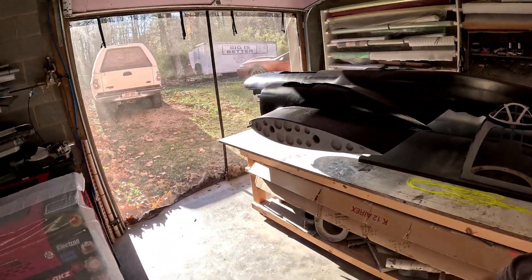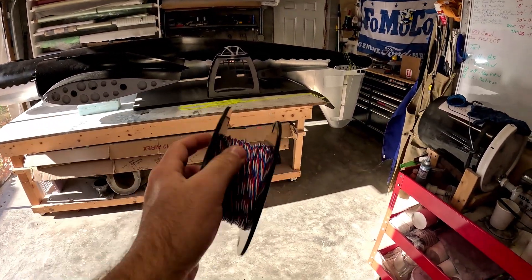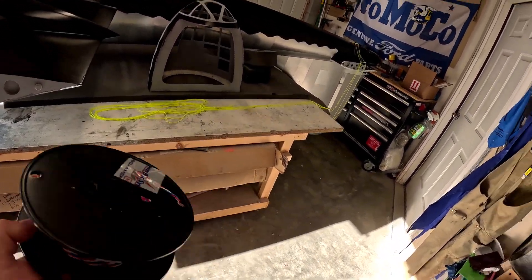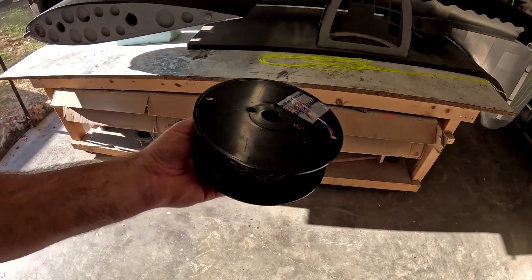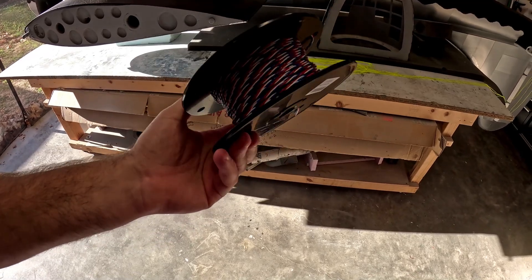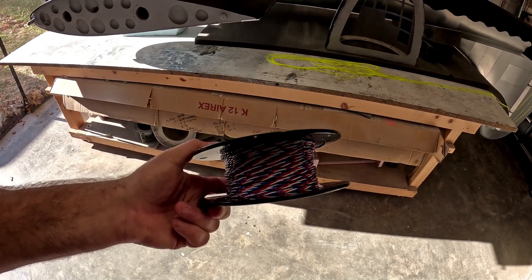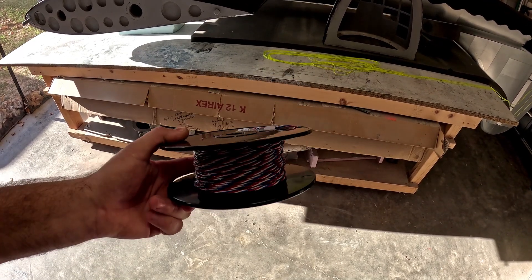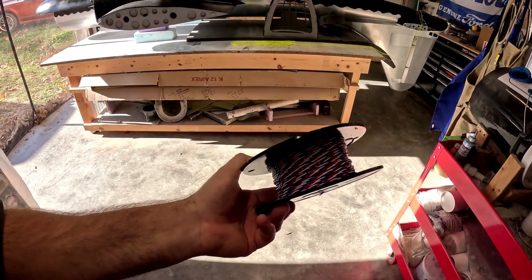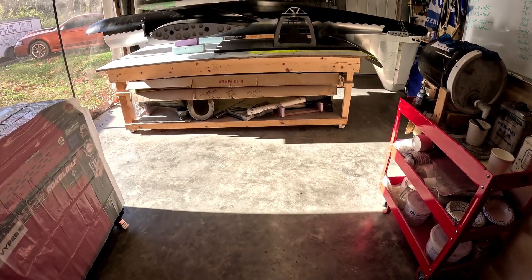We're going to make all new extensions using Power Box maxi wire — it's a 50-meter spool. Doing the math, it's a surprising number: using the Power Box wire over conventional heavy-duty servo wire saves three pounds. That's right — 3.0 pounds just on wiring for the servos. So we're going with that purely for the weight savings.